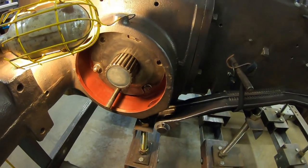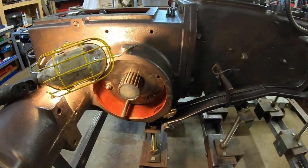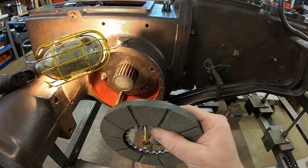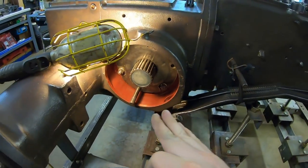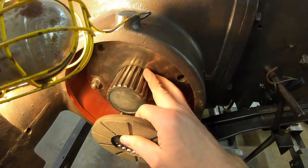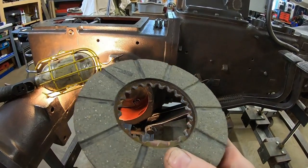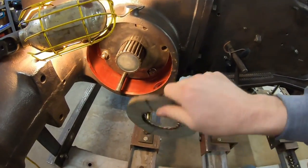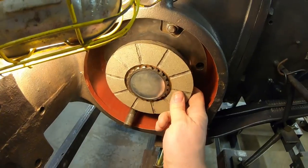Now, we also have the X factor of a production bull pinion in a prototype plate, in a prototype case, that increases the margin of error as well, throws a few wild cards into the mix. So all these factors combined, the disc had to go in so far that I was getting into the root of the splines where they start to ramp up and go to full shaft diameter. So these wider teeth were starting to catch on the ramped portions of the bull pinion, and they were starting to tighten up. So all this fresh, shiny metal, I had to put a three-sided bevel on the insides of the teeth on the innermost discs. And that created enough clearance that I get a free float. We can go all the way up, hit that plate, everything fits just fine.